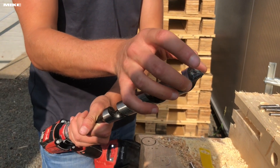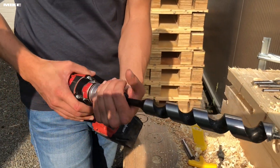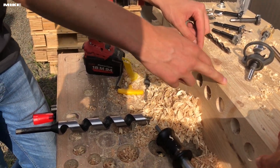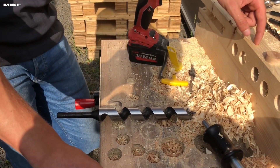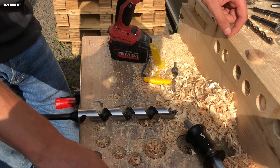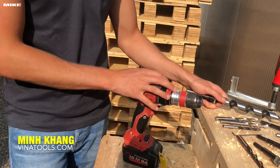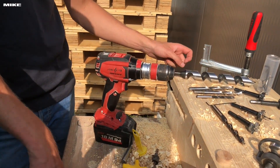The machine needs to be very strong, but yeah, it is easy to handle, because of what was already said — the drilling happens at the head, the rest of the drill is nothing more. This auger bit is made for this — this is the classic application, the classic wood it is used for. You can drill it in European hardwoods, but not for very durable or hard woods. So for deep holes in hardwood it would be the ball auger with the extension. Yeah, exactly.